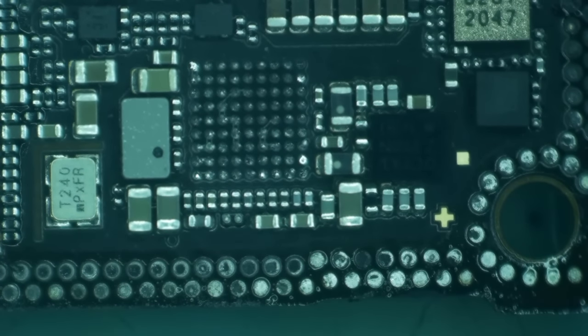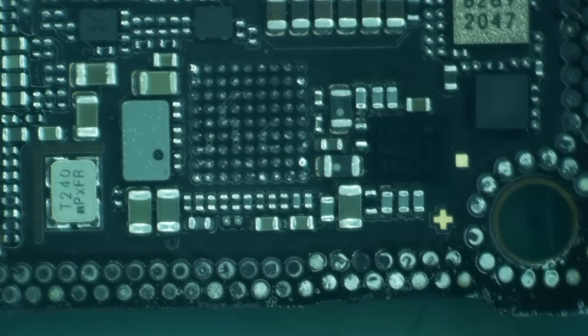Now, I'm not too concerned about really overheating and screwing this board over right now because it is about to have literally nothing on it that I need, that is after I'm finished with that Logic EEPROM IC. So warming this right on up, I'm going to grab the NFC. I'm actually not even sure if NFC is necessary anymore. I'm sure you can just update and get around it now, but I'm seeing that people may not be transplanting that at all. So, okay, there's NFC, and I'm going to reball it and then come back for this EEPROM.